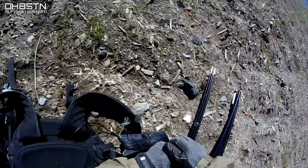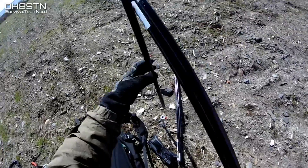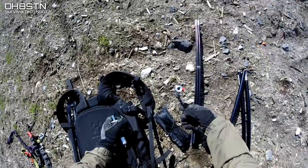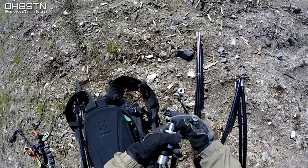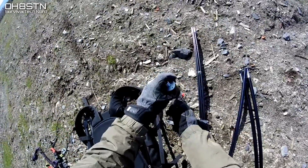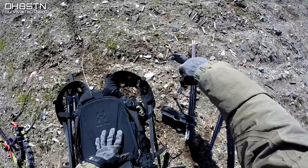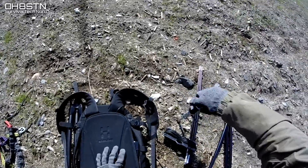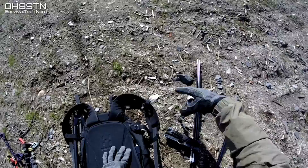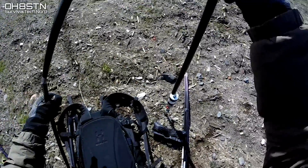This is the very first time I'm deploying it for real and I'm hoping the ground isn't still frozen. I nearly forgot the Hybrid Micro — let's go ahead and put that on top. I'm not using the thumbscrew to mount the counterpoise. Personally I like to put the counterpoise wire between the Hybrid Micro and the base of the spike. This way I don't have to worry about fiddling with or losing that screw because I'm wearing gloves. Now I'll tighten down the Hybrid Micro, compressing the ring from the counterpoise system between it and the spike.